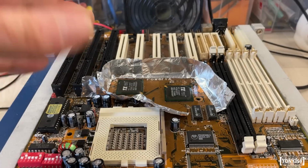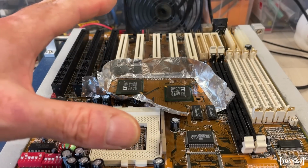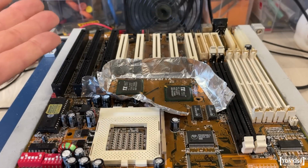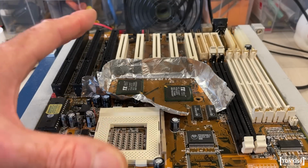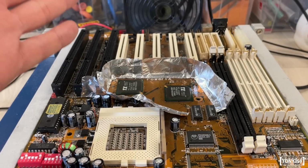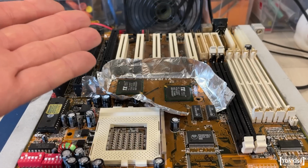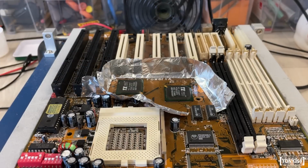Again, I totally appreciate I should have nudged the chips to make sure they were floating. I tend to get a bit nervous in these moments, especially on something that is kind of working, so I'm trying to repair it. And my hands were not the steadiest I could get. I totally felt, had I touched the chip, I would have misplaced it. So I just trusted my thermometer, which was giving me pretty much an accurate temperature, and I'm confident that I managed to reflow those chips.